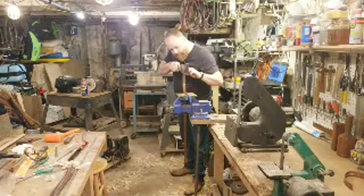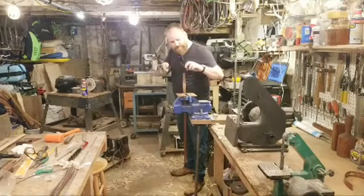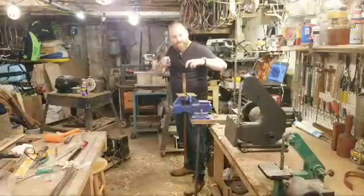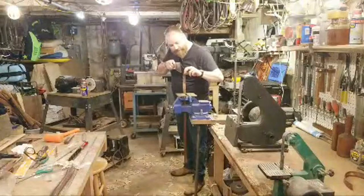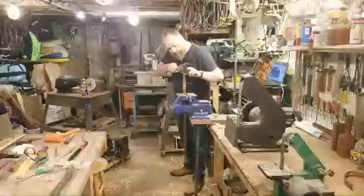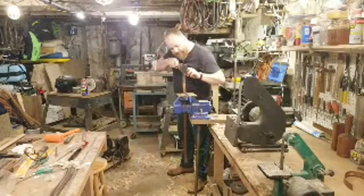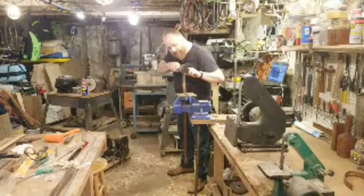I just put my fingernails right where I want the saw blade to cut. It's just resting against my fingernails, not underneath them. They help keep the blade running straight where I want it in two spots, the front and the back of the head. Started just a little bit. See how it's going. Double check it. Do a little bit more. Double check it's right where I want it, front and back. Looks like it is. Obviously, it wants to follow along that existing kerf.